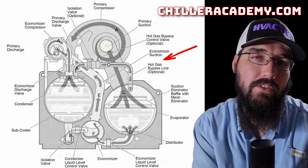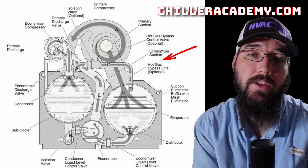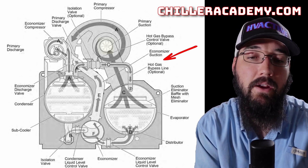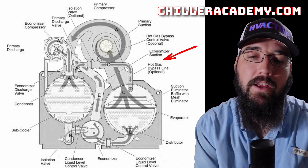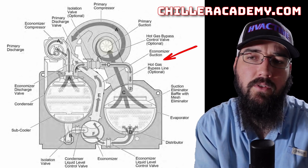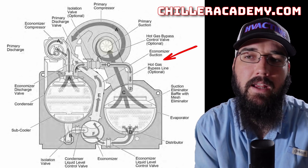There's a whole lot of balancing act happening here, but that's the detail behind why this compressor works and why it makes sense. These are very viable designs — I think this is a really cool thing that York is developing. It's definitely a bit complicated, and we'll see how it works out long term. They've had issues, but every machine trying something new is going to have issues. As York gets those resolved, like others have — the Daikin WME had all kinds of problems especially in the drive package and they got a lot of that resolved; even Trane has had several bearing issues and tried ceramic bearings — these things happen when you try something new.